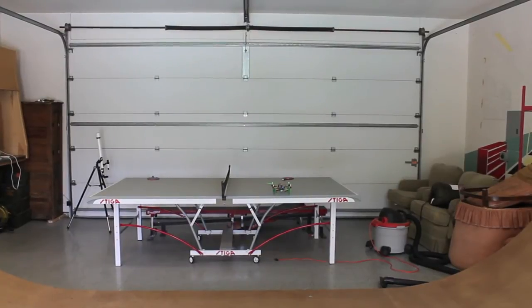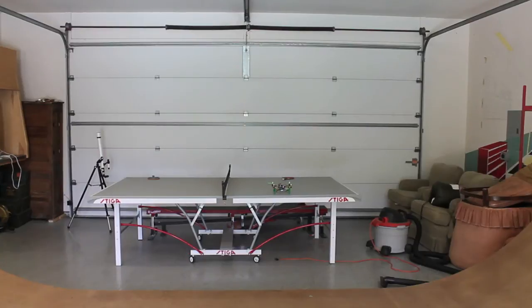Okay, so with the calibration routines that we went through, I'm going to go ahead and arm, and our board is arming. Give it a little bit of throttle just to make sure that everything's responding. So nice and stable. See a little bit of oscillation. Now I'm flying in the default flight mode 1 of stabilize. You see how it kind of comes back to level. Pretty dialed in.